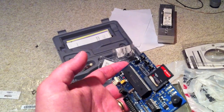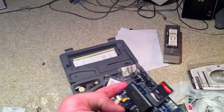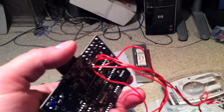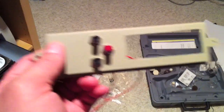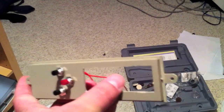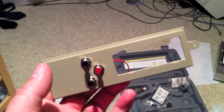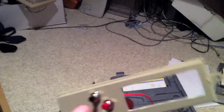I should have taken video at the beginning of this process, but it didn't occur to me, so I'm pretty much done. This is the board in question, and here I've got it wired — I've wired a set of front panel-mounted buttons. This is the Amiga 2000 5.25-inch faceplate, and I've got up, down, and select buttons wired in there. This is the opening for the two-line LCD, which you don't actually need on the Amiga because there's an Amiga-based floppy selection program, but it makes it a little easier, so I went ahead and used it as it came with the system.